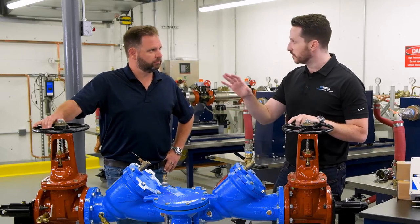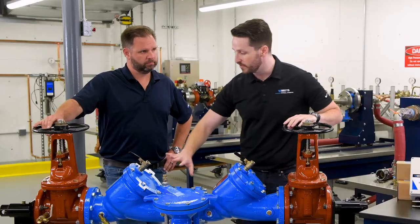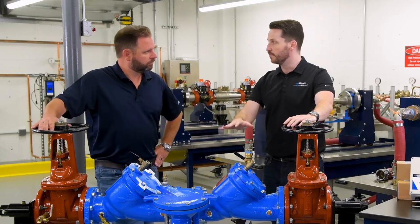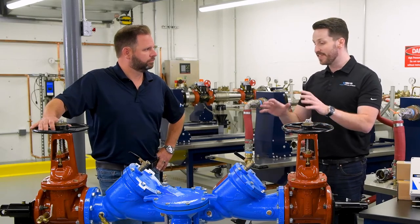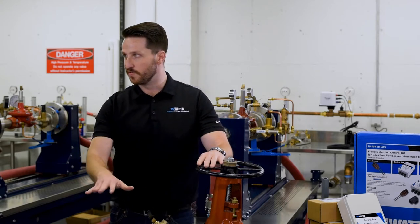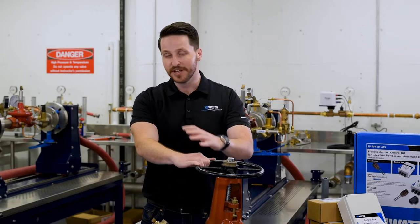What a lot of people don't realize, especially the customers who actually own these valves, is that this can put out a lot of water in certain situations. You get a big piece of concrete, two-by-four, pipe scale stuck in that first check — the relief valve's going to open and it's going to put a lot of water on the floor. One big problem we run into is that mechanical room drains just aren't sized properly for that catastrophic amount of water that can come out of this relief valve. You've got potentially thousands of gallons coming down, trying to be choked down by a two or three inch drain in the mechanical room. These are usually tucked away somewhere down in a corner of a basement or in a mechanical room behind a locked door, and you don't realize it until you walk by and your feet go wet. But then it's too late.